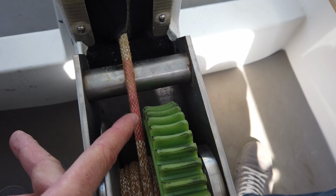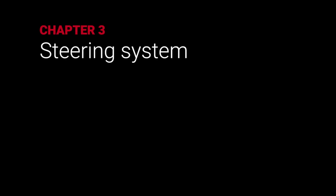After using the keel winch system for a while, the Dyneema rope and the loop on the head of the keel get stretched a bit. And that's why the marks on the rope are maybe not exactly precise anymore. Lift the keel completely and mark the new completely up position with a permanent marker. Later, when you are in the water, do the same for the keel down position, which will be even more useful because exactly aligned holes of the keel and the keel box will make the insertion of the safety pin easier. At this point, also check that you have some spare safety pins on board.